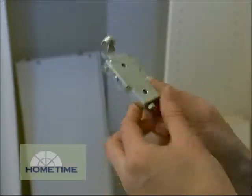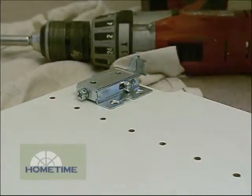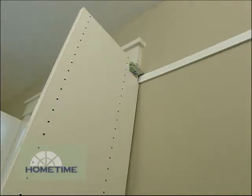From there, the cabinets just get built piece by piece, starting with the end panels. This here is a crucial piece of hardware to the operation — it's called an adjustable hanging clip, and it just goes right on top of the panel. Pretty easy to attach; just use a couple of euro screws. Then you just hook it over the top rail, and it locks into place.